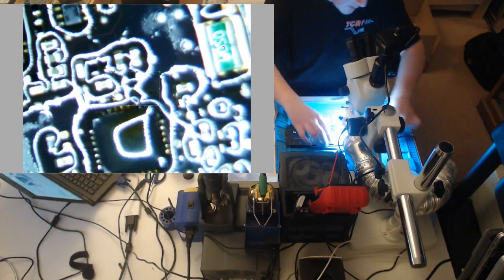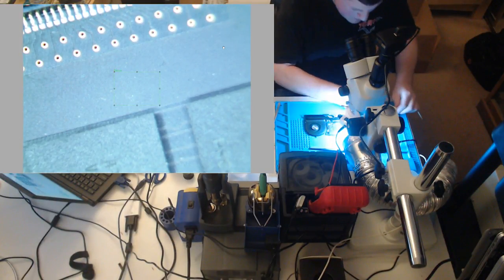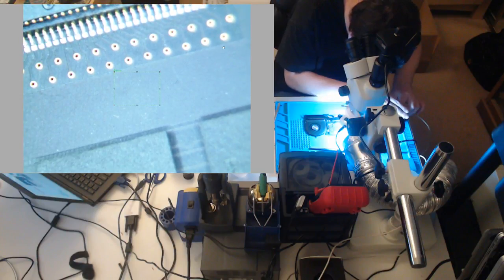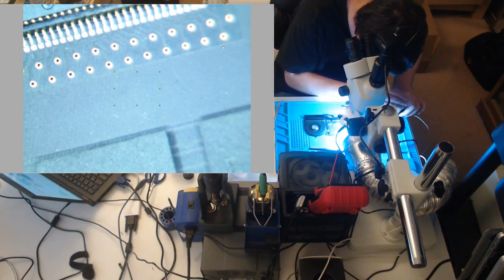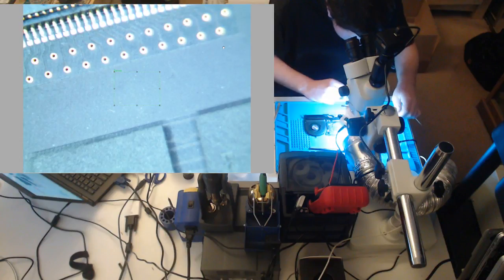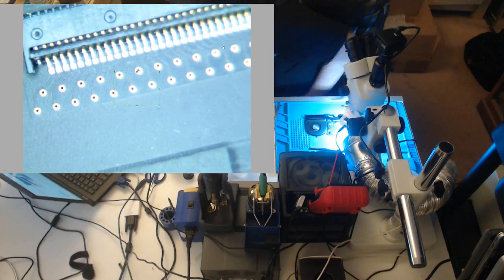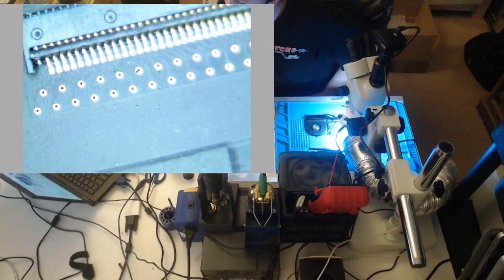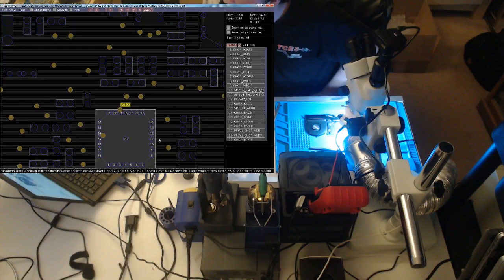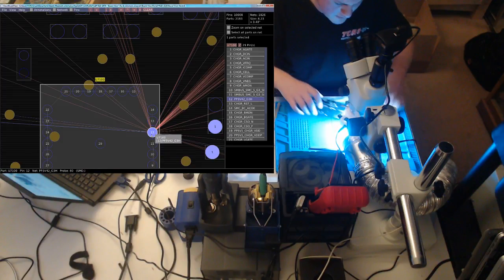Let's double check this, but honestly, again, with the charger being shut off like this, it could be the DC in board. I highly doubt it. Wait a second here. I don't know if it's my eyes playing tricks on me, but yeah. This one, hard to say what happened, but how does solder pad 12 look? You're talking about SMC, BC, AC, okay. Let's see. I think that was one I just touched up. Oh, 3V42. Let's see. I don't think that's our issue, but let's look.